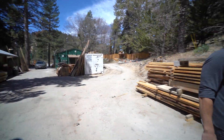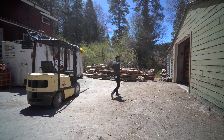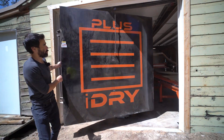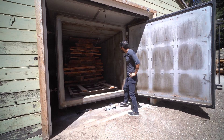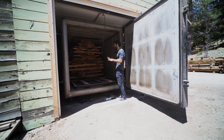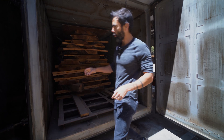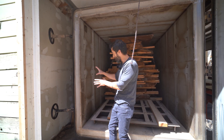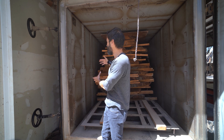I love being in a wood yard surrounded by slabs — so many projects. Over here we have the iDry. It's like opening a submarine. This is some walnut they've had in there, and generally they're about 30 days per load of wood to completely get it down to right around 7% humidity. It's all computer controlled, super precise. Look at how thick these walls are — this is not just a shipping container with a dehumidifier.